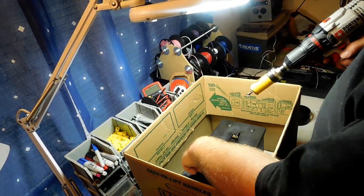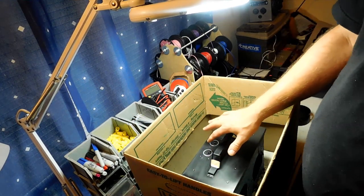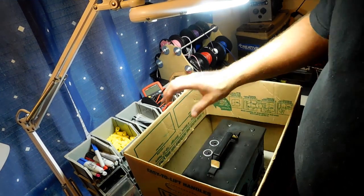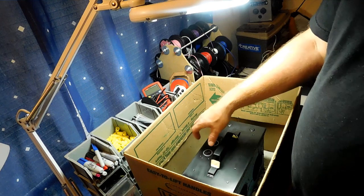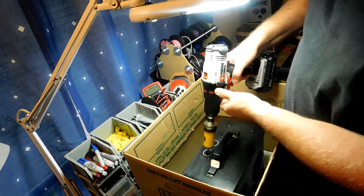When you're drilling the tops, it's a little bit different because there's actually two layers of sheet metal that make up the lid — that way the lid is extra strong. You're going to go through one layer, you'll feel it cut through, and you may have to pull that off the top, take that little extra piece of metal out of there, and then drill it through again. You'll see that when we start drilling here.